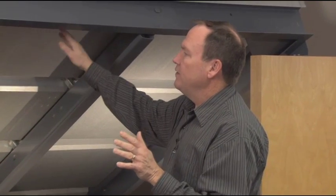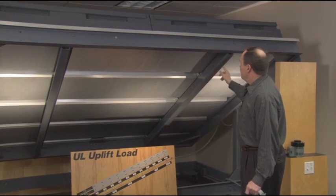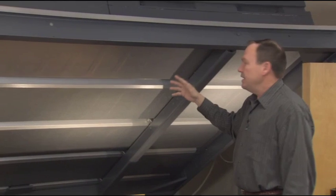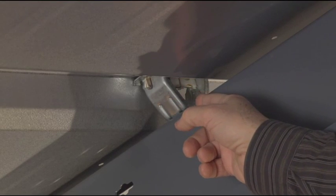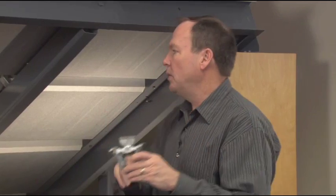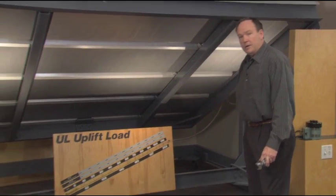With this test, we're looking at a 10-foot square piece of roof, just like it would be in your building. We've left off the insulation on the bottom so you can see underneath — any liner and so on — just to see what's going on. Here you have the typical purlin spacing, roughly five feet on centers, or whatever spacing you want to test to. The attachment clips back here attach the roof to the purlin system. This is a typical clip and a large diameter screw bolt fastener for that attachment point. What we're going to do is evacuate the air on the top side, let atmospheric pressure push up on the bottom side, and create an uplift force, which is measured in the manometer here on the ground.